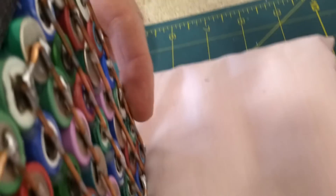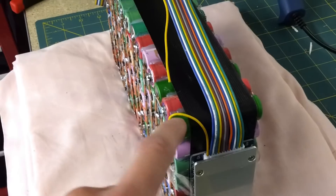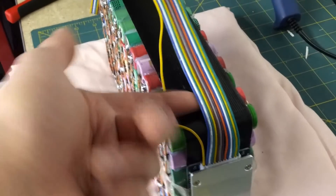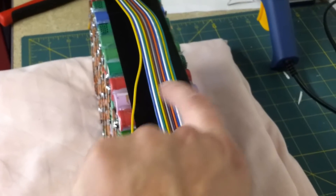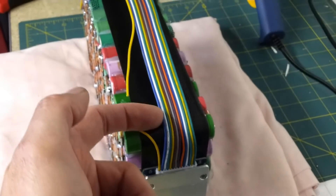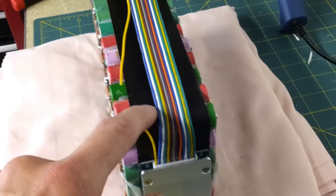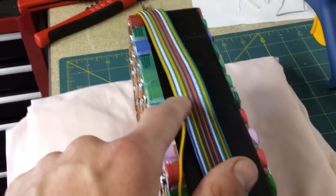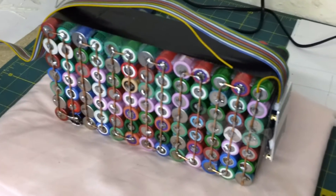That is the positive rail, not connected to anything else. I've just bent that one around the corner, tinned it first, and soldered it on there. I'll now be running along and snipping this one. Annoyingly, I'm not sure how other people get around this — I've yet to watch some other videos I guess. This one here will be the next one, and I'm going to need to put it under this whole pack because I'd like to make this look reasonably neat. So all these wires are going to move down here, coming off each way — left, then right, as we go over. I'll just be using small blobs of hot glue just to keep them in place and make them as tidy as possible. It won't be a pretty pack, but it hopefully will be functional.